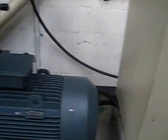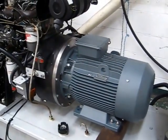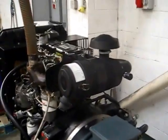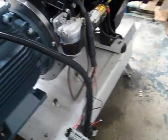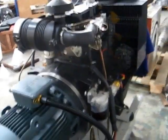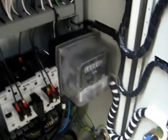If we push this generator up 15 to 20 rpm above synchronous speed, we'll be getting around 15 kilowatts of power pushed onto the grid. I'll then switch the engine off very simply by disconnecting the fuel solenoid wire — the fuel solenoid will stop fuel going into the engine. You'll hear a change in engine note, and after that the motor will be driving the engine. At that point I'll show the meter going backwards.